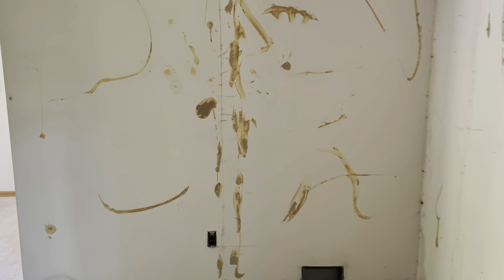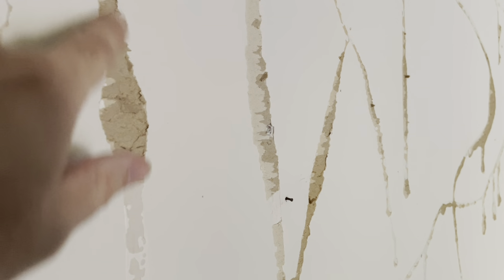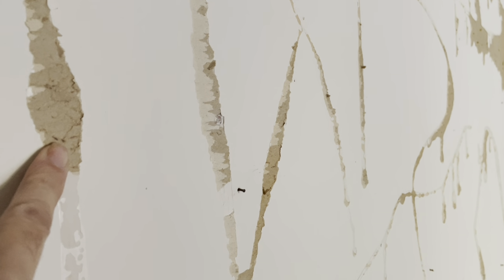I already took off some of the paneling and you can see — look at this glue. This is liquid nails. They use it to help adhere the paneling. In this case it's really not that bad; they didn't put that much down. There are two different situations you can get here. You can see from a profile view where the glue is still on — to me that's a bigger issue. Over here you can see where the glue actually peeled the drywall off. For me, because I do a lot with drywall, it's not that bad. I'll just come back, sand this down with a pole sander or palm sander, and fill it in with some mud. It is a lot there, but it's the price you pay when you take the paneling off.